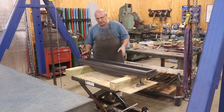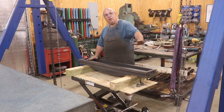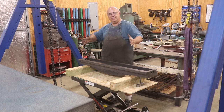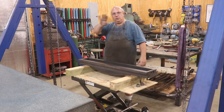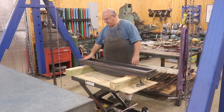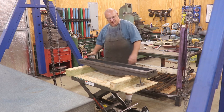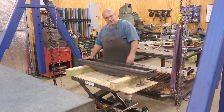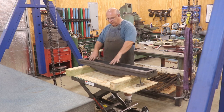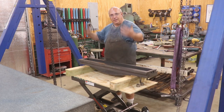The next piece I'm going to be working on is this piece I got here on the table. This is the crossbar that goes across — it basically goes up and down the two uprights — and there's a clapper box that moves left and right on this. What I'm going to be working on today is getting the surface that the clapper box rides on, getting all that nice and flat. There are some alignment issues we're going to have to work on.